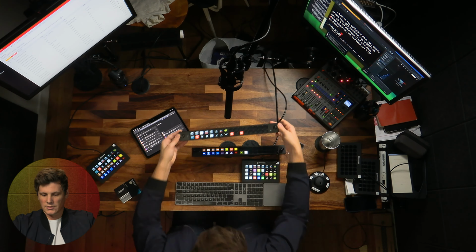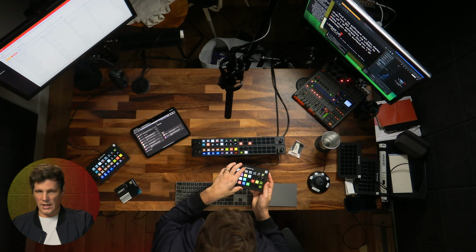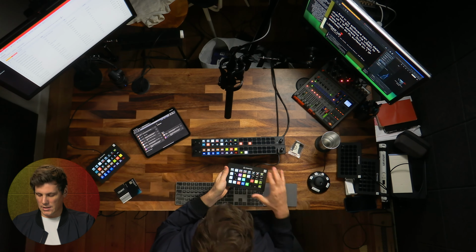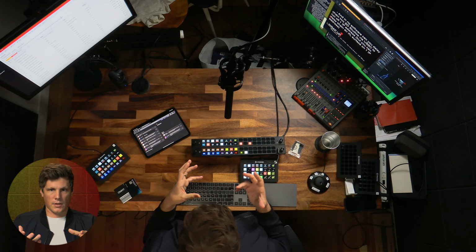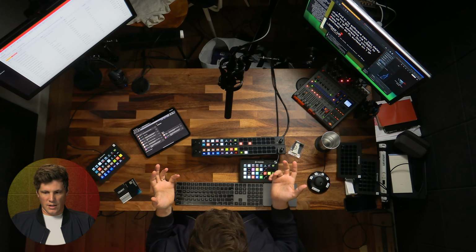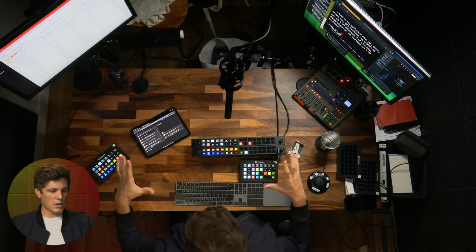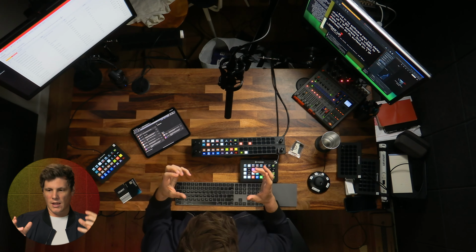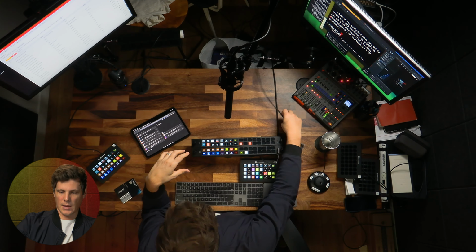Ideally, what I want is something like the Stream Deck XL, but that has some rotaries and other control things, like PTZ control, and something with PoE ability. Installs that I've done for clients often run up against a problem: if you've created a workstation for someone, like a control room, and then you have a rack further out of the way, you run up against that USB problem of only 6 to 15 feet before you've got problems with the peripherals. So having the network cable is so good.